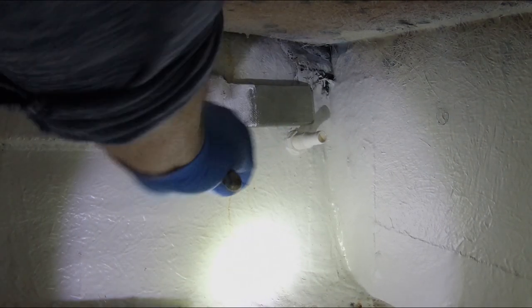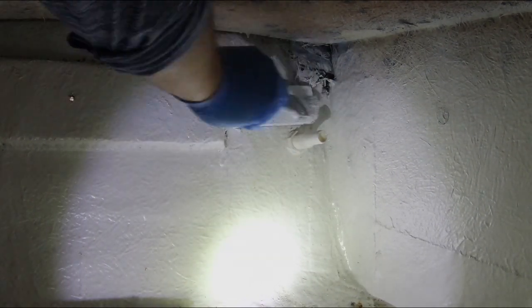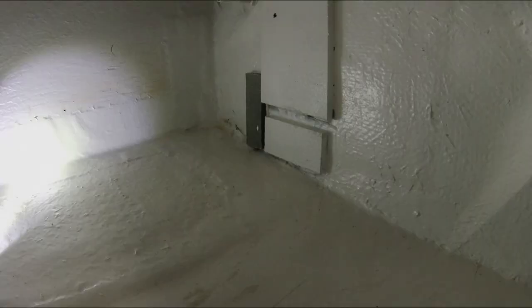The issue is that inside the Albin 27, because of the pan liner, I don't have access to the interior of the hull in many places. The only place I can actually access the hull for through-bolting is the aft cabin of the boat. Because through-bolting relies on the strength of the connection to the hull, everything has to be done with backing blocks and large fender washers. Luckily, in the Albin 27's aft cabin, the original locations for the rubbing strakes already had backing blocks fiberglassed into the hull.